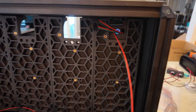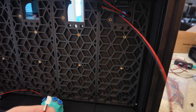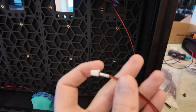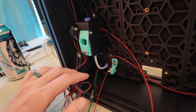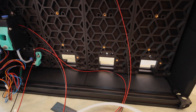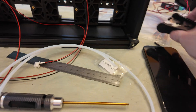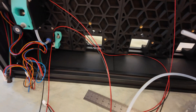This is where the FormBot kit really shines: installing the spoolers. Because each wiring has exactly the length the instruction manual calls for — 550mm for the run — I know exactly which spooler plugs into each slot because everything is perfectly labeled. The PTFE tubes that connect here, FormBot supplies as a raw run of tube that you cut yourself, but they include a nice PTFE cutter tool which is very handy. It provides a very clean edge and you don't have to worry about messing it up with a knife.